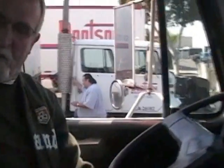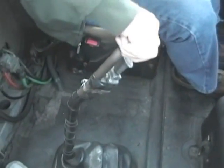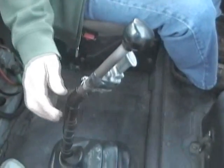Okay, from there, just going to point behind the passenger seat. Those are my reflective triangles. I got 3 of them. They're in good condition in case of a breakdown. From there, I'm going to come up to my shifter. Make sure my shifting arm's not cracked or damaged. The shifting crown's secure. My splitter shifts in both ranges and it's not leaking from the airline.